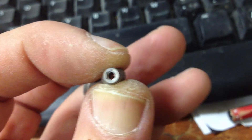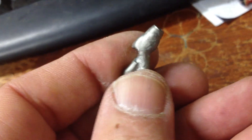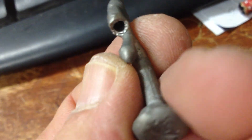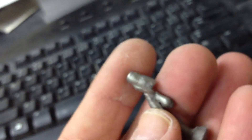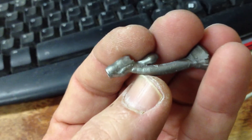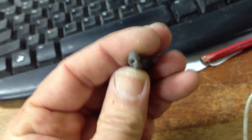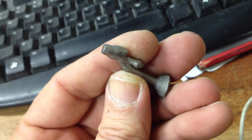In a nutshell, this is a really cool, cheap, and effective way to give you custom metal pieces. If you do it right, you can get an accuracy of these investments down to 7 micron in dimensional stability — basically, there's not much you can't do. For all the 3D printer guys, they can print pieces if they need threads or anything like that — leave the nuts in, invest them and cast them, and you can get something like this with a machine surface or a nut fixed into position. Out of most metals, you can do that yourself and get results which will rival much more advanced technology, with good practical working skills, at a fraction of the cost. Anyway, post your comments. Thanks, bye.